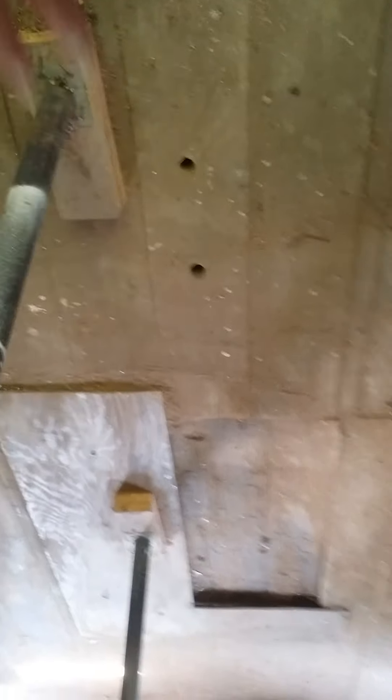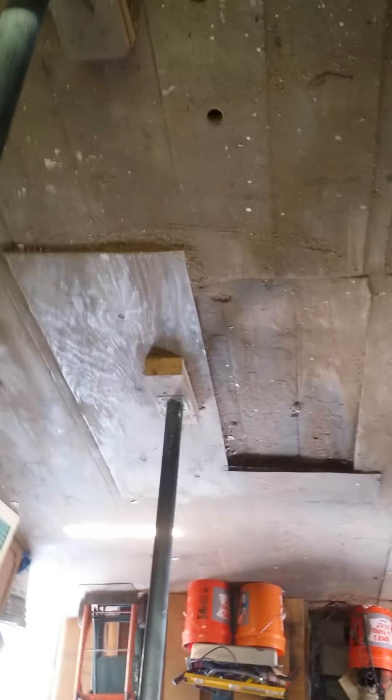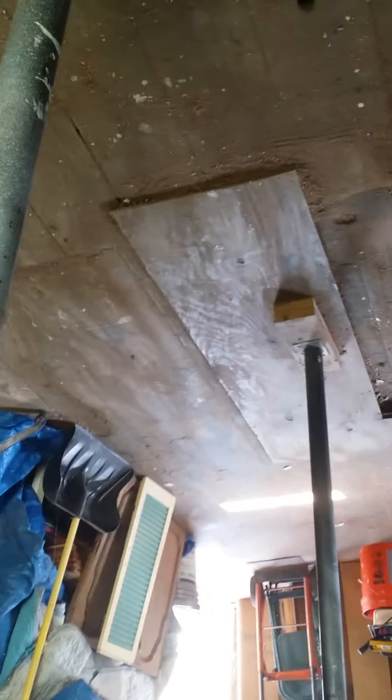Underneath this entire floor, basically you've got your rafters overhead — it mimics underneath here. So we're going to sister up where necessary and tie in new wood as seems appropriate. That's what's going to start on Monday. In the end we hope to have the entire perimeter of the barn with concrete, or cinder block, or footing — something, but probably concrete.